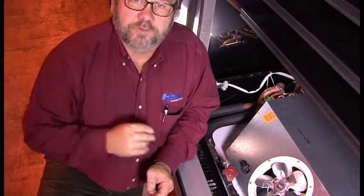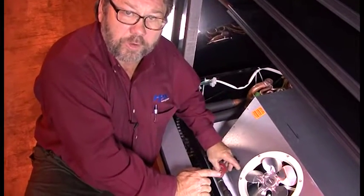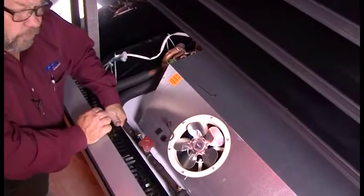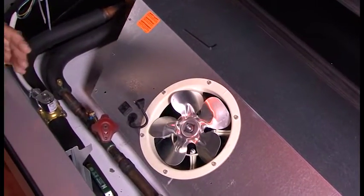Once we have that setting, we'll lock it down. Let's go over to the case and set our valves. First, let's de-energize our fans. We also want to remove the discharge air grill so that we have a little more room to work. Now let's go ahead and close the valve all the way to zero.